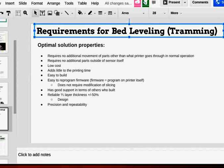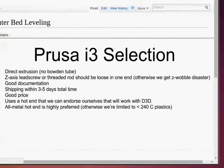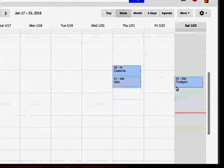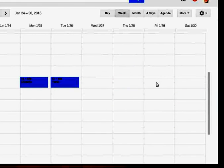And the detection happens, you actually detect the voltage requirement, or you still have to set it manually? You just specify the voltage you want in the firmware, in the code. Which can be automatic based on a reliable source for the steppers. Yeah, when you know which steppers you use. You can find the right voltage and just punch it into the firmware and upload the firmware.